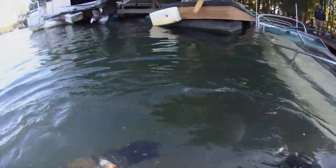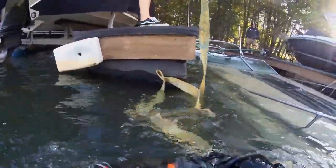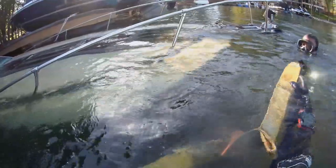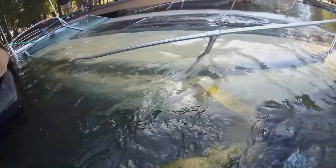I put my hands on the vents. We've got to make sure that once we lift it up high enough, those vents come out of the water so that as we're pumping, we're not just pulling water straight from the lake back into the vessel. We're going to hook up the belly bands now. Like I said in a previous video, if you guys go hammock camping, they're basically heavy-duty hammock straps with loops to hook your lifting devices to. One diver is going to be on each side — I'll be on the starboard side — and we're simply going to swim the bands all the way up underneath the hull and back to the stern.